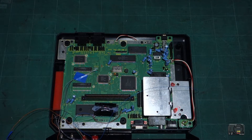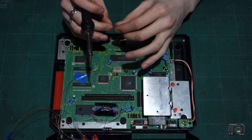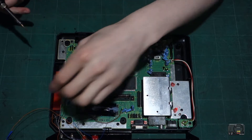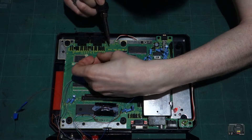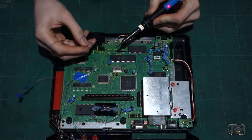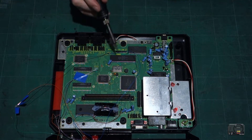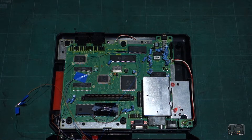Okay, that's our points done. Let's add our blue cable to point one for our power - just make sure your exposed wire isn't too long because these points are quite small and you don't want them falling out. That's one done, and our black for our ground to point two. There we go - a little bit too much solder there, just going to get rid of a little bit. Right, that's done. So now let's add some power and just make sure our switch is working.